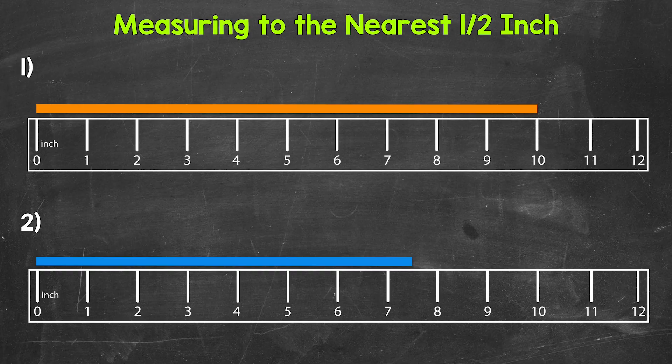We have a 12-inch ruler, so one foot, and each inch is marked along the ruler. We have the zero mark where we start our measurements, then one inch, two inches, three inches, up to 12 inches. The left end of the orange bar is lined up with the zero mark on the ruler — that's our starting point. Depending on the ruler you're using, there may be a small gap between the end of the ruler and zero. So it's important to line up whatever is being measured with zero and measure from there. We don't want the gap included in our measurements.